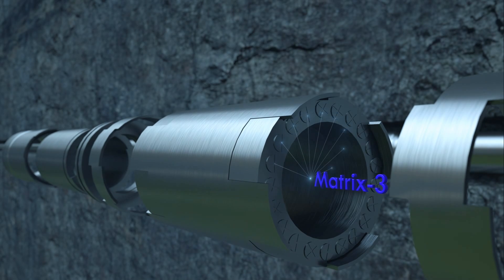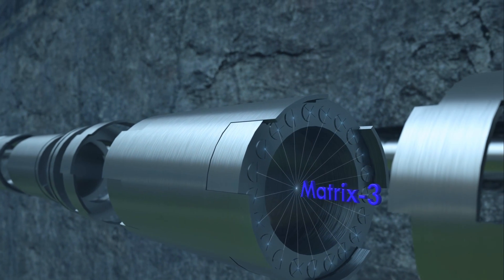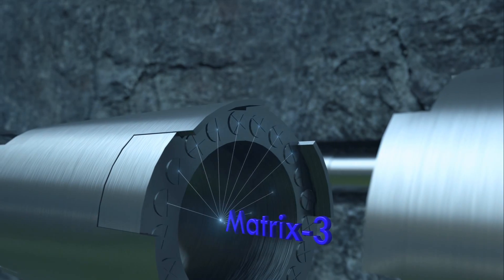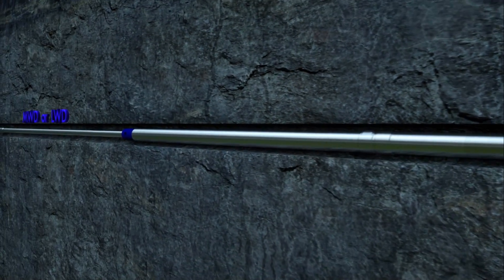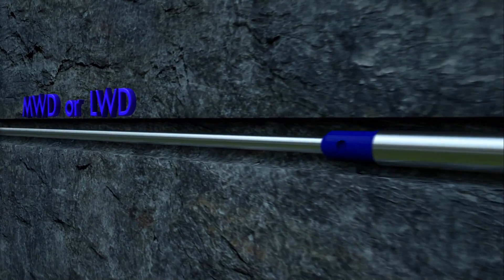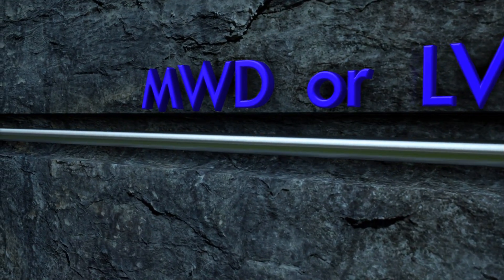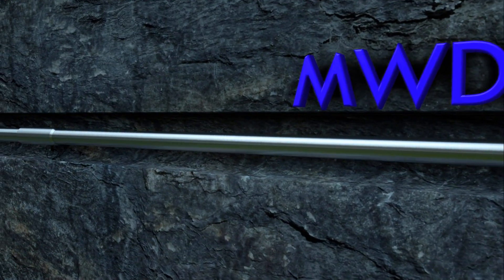Our Matrix 3 bearings are made out of an incredibly hard composite and are metallurgically fused to the base metal to create an inseparable bond. Above the motor is the MWD or LWD. The MWD measures the drill string orientation in real time and the LWD logs the formation of the properties being drilled.